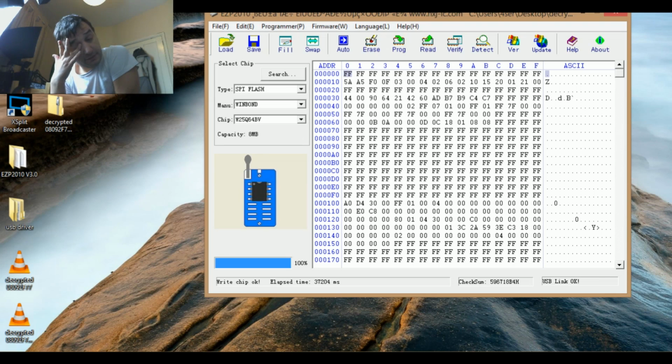It can be the BIOS, it can be the processor, it can be the video, it doesn't matter, but in this case there were only two cases, because it was charging, everything was good. When I was connecting the battery, it was charging the battery, but it didn't power up. So in this case, I was very lucky to actually fix it. Not lucky, I wouldn't say lucky, because there were only two options, reprogram the BIOS and reflow the processor.